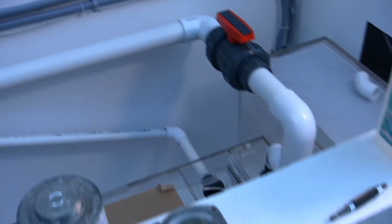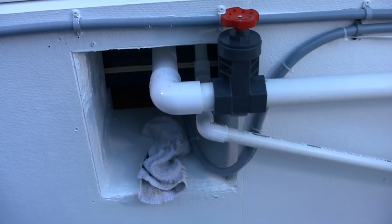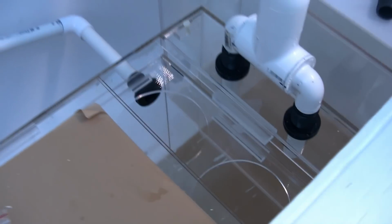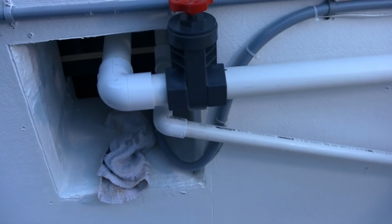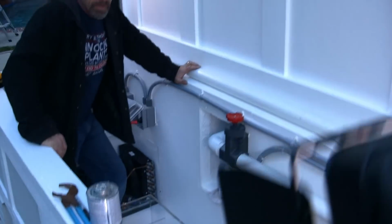Okay, so the drainage out of the tank via the internal overflow comes out of the back of the tank through this cutout in the wall into our filtration cabinet. The big 2-inch line is the actual Durso siphon or standpipe that's in the overflow, and that runs all the way over into the top of the sump. It splits into two. It'll then flow over and into some socks that'll be in there and then into the rest of the sump. In addition, there was a 1-inch pipe inside the internal overflow that serves as an emergency overflow in case for some odd reason the internal overflow itself gets too full, and that line runs out and comes into the side of the sump there as well. So the drainage portion into the tank is coming along.